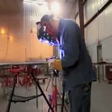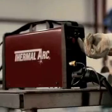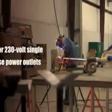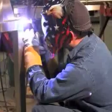Each unit, excluding the 95S, has built-in power factor correction circuitry, which gives welders a more powerful and efficient output. The multi-voltage input power provides the ultimate in welder flexibility, allowing you to hook up either 115 or 230 volt single-phase power outlets. Note that the 95S is 115 volts only.